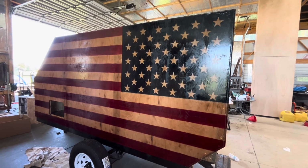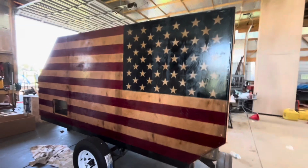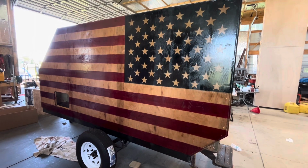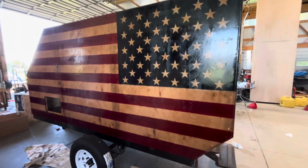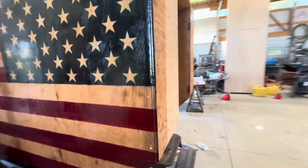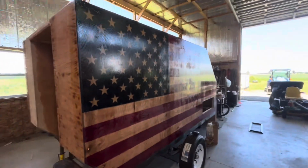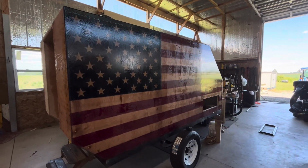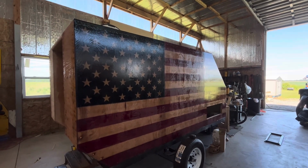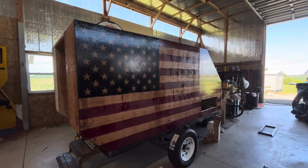So I'm gonna put another coat on today and maybe put the coat on the top and fiberglass on the top. I'm not really concerned if you can see the fiberglass or not on the top. So that's my plan. I will continue on today finishing the epoxy. I do have to order another jug of it to finish the final coats because I don't think I'm gonna have enough. 1 gallon isn't enough to do it all.